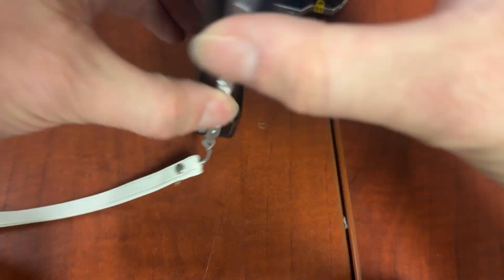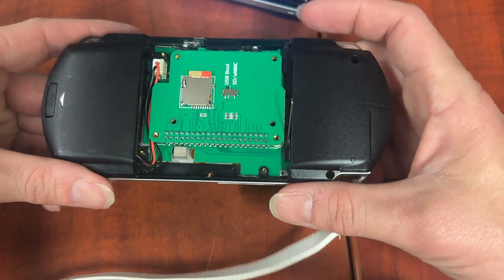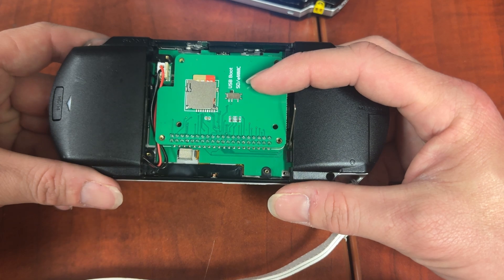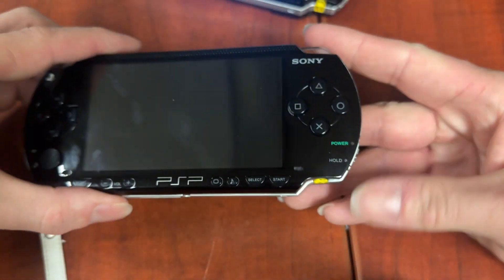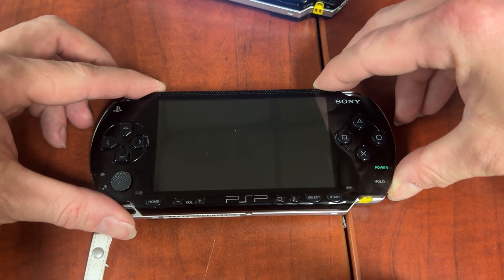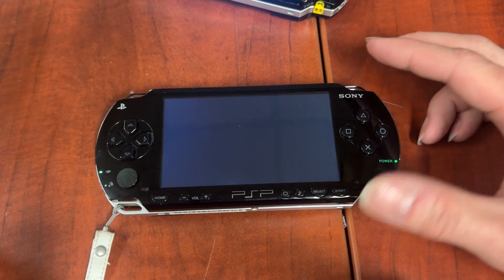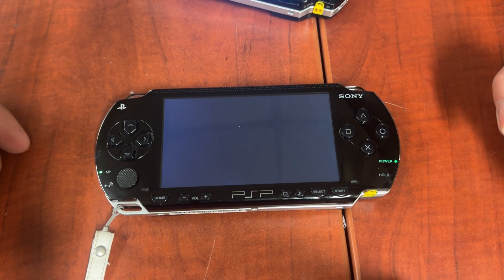So when you flip over the PSP, on the carrier board you'll see a little switch - USB boot on one side, SD-EMMC on the other side. When you have this problem it almost always means that you're flipped over to USB boot. The Pi won't boot properly - it can't read the SD or the EMMC storage if you don't have that switch flipped to the right one. Flip it over and boot it up.